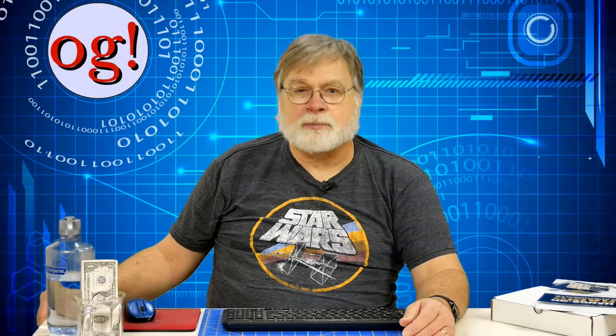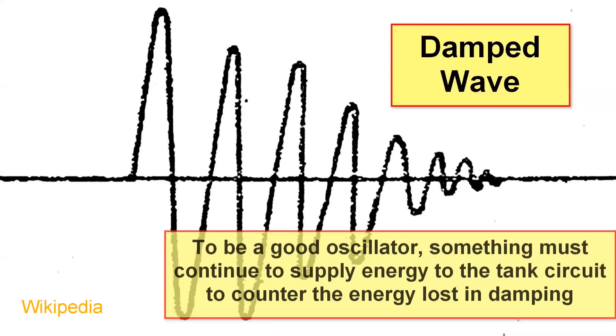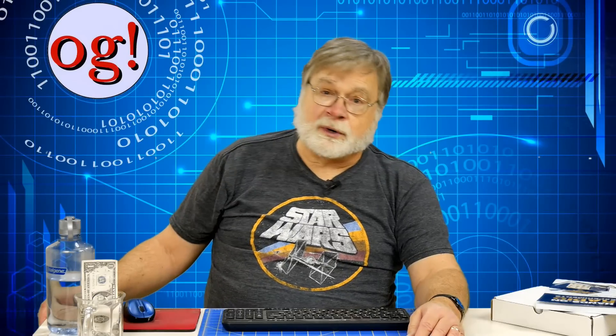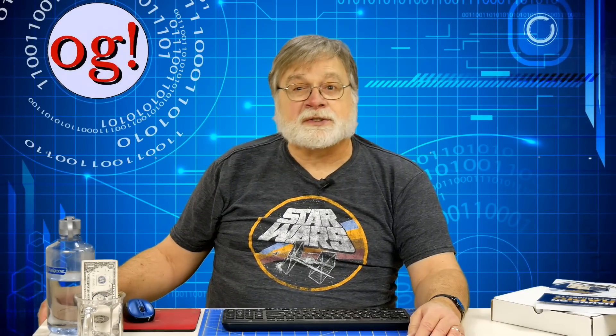This creates a sine wave across the tank circuit. This effect is called ringing, since it very much operates the way a bell works. If there were no resistance in the circuit, the ringing would continue indefinitely. But there's always resistance, so the wave will die out pretty soon as the energy is dissipated in the resistance as heat. The rate at which the tank circuit rings is a function of the value of the inductance and capacitance. Resistance isn't involved in determining the frequency, although it greatly affects the rate at which the ringing is damped down to zero.